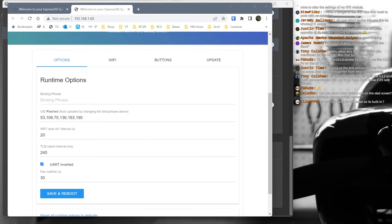When you try and write a firmware that says not enough space, there's about a 50-50 chance you just bricked it. Sometimes it works, sometimes it doesn't. Sometimes it goes into rapid flashing mode. That's why I'm saying this is an intro class, and as an intro class, I highly recommend the use of a dongle. Even if you know exactly what you're doing and you put a bad flash on the module, either the receiver or transmitter, you're going to need the dongle to recover it. The dongle is kind of like a fail-safe method of doing it. It just works. And even if you screw something up, you can get it back. So definitely use the dongle.